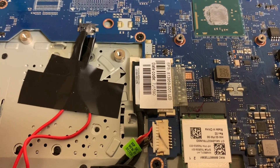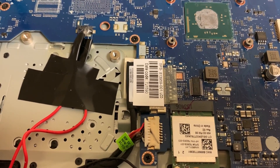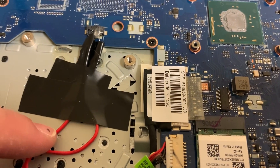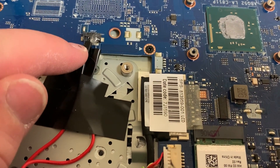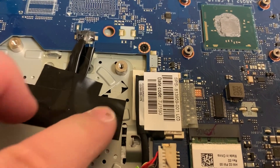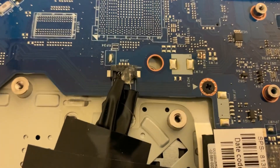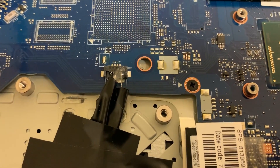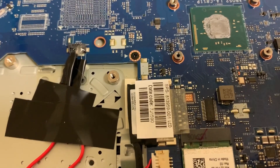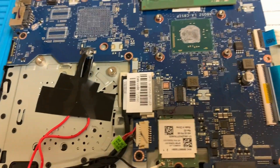So I thought, you know what, I'm just gonna hotwire this thing. I wish I would have got this on video beforehand, but I finished and decided to put it on YouTube. I ran some speaker wire into the jumper and soldered it onto the pins. I wrapped them with electrical tape to secure them from moving around, and put a little dab of hot glue on there to secure the joint really good.